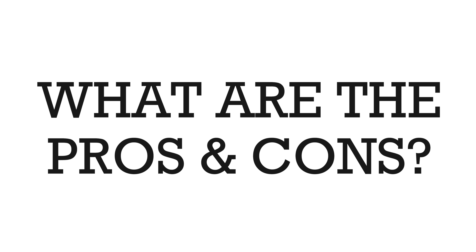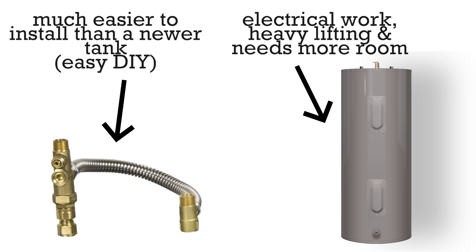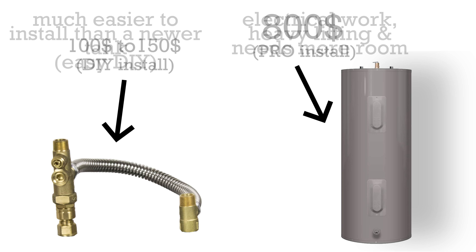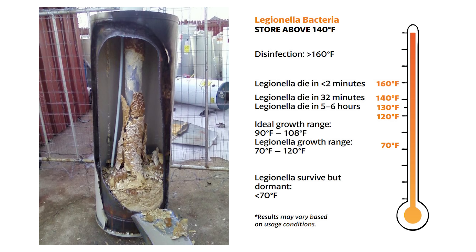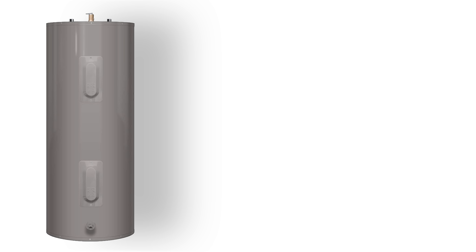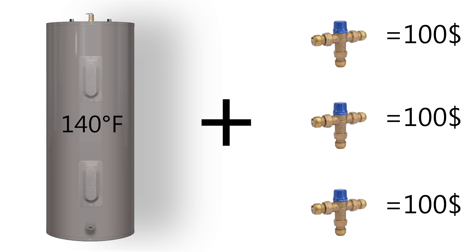So what are the pros and cons of having one of these? First of all, it's much more convenient to get a valve like this than buying a bigger tank, and it's also a lot less expensive seeing you could easily install them yourself, even if you're not the handy type. All tanks should be maintained at 140 degrees Fahrenheit to prevent Legionnaires disease, which is a severe form of pneumonia, and this valve allows you to do this task safely. Some plumbers will say to set your default temperature to 140 degrees Fahrenheit and install mixing valves at each fixture that uses hot water, but individual mixers are almost the same price as this valve, so the total cost would be more depending on how many fixtures you have.